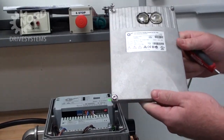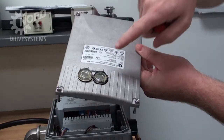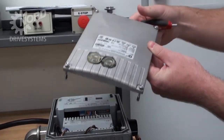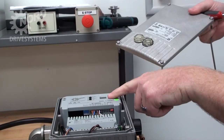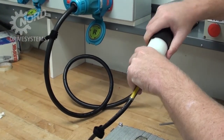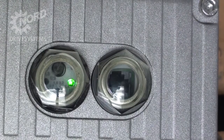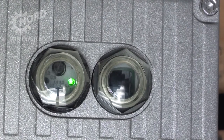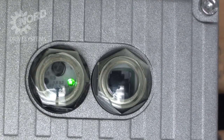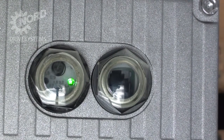When commissioning is complete, reattach the motor control's cover using a 4 mm hex T-handle. It's important to put the cover on in the correct position so the plugs line up with the access port communications. Turn on the line power. The motor-mounted SK-135E is now ready to run. Through the view plugs, you can see a green light flashing when power is applied. When the motor is turned on in either forward or reverse rotation, the light will change to solid green.